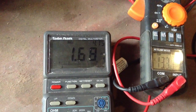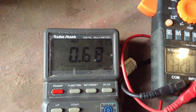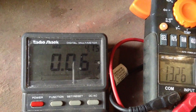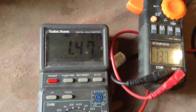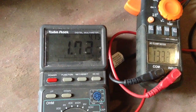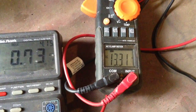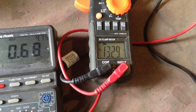We're in the 5 to 10 mile an hour range right now, and the max amp input so far has been 4.15, which is pretty decent. Hopefully when we get a good steady 15 mile an hour wind, we might hit around 8 to 10 amps — that would be awesome. And we're charging the battery now. This was a pretty full battery to start with, sitting at like 12.7.